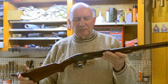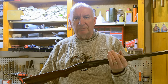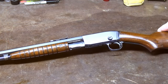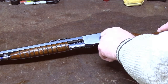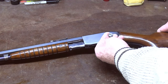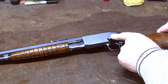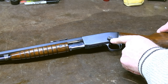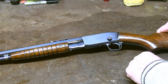Before we sit down and talk about this gun, let's take it down and show you how you'd clean this one up. As with many takedown .22s of the era, this has a very simple thumb nut on the left side. Simply unscrew that. Even though there's a slot here, this should never be tightened with a screwdriver — it's dished out so you can use a coin, a penny or a nickel, whatever fits in there.